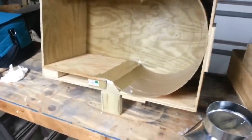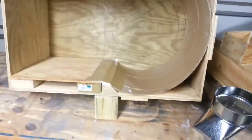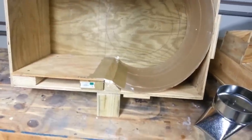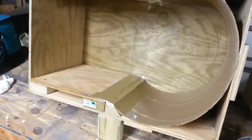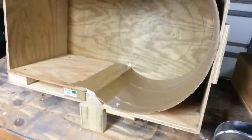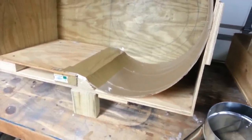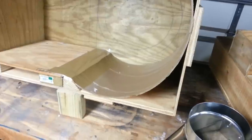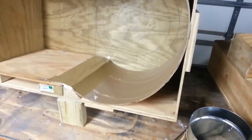I can try different mixes of concrete if I need to. The 20% concrete and 80% perlite is my first and cheapest route. If that doesn't work, I'll go to more expensive things like using fire clay and that sort of thing.